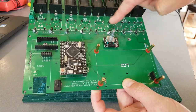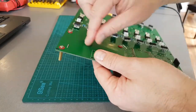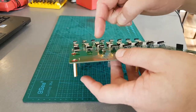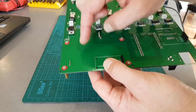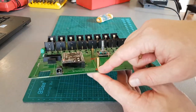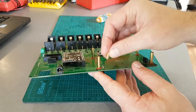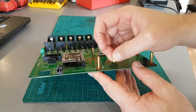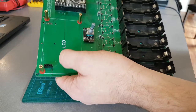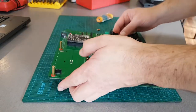It's split here, and then this is 5-volt coming in from the power supply - the TP5100 or TP4056, sorry. What you've got to remember is if you scratch the top over here and you have a header or standoff, that's going to short the top voltage plane to the bottom voltage plane, which is ground to positive - not a good thing. So I do recommend getting insulator washers.